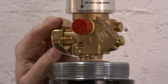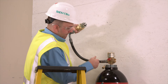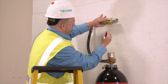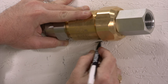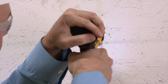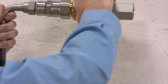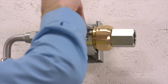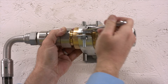Now you can return to the cylinder and remove the valve cap, then proceed with connecting the discharge assembly. For this video, we're installing the assembly in a horizontal layout for easier viewing. Most job sites would require this to be in a vertical orientation since the pipe will run along the ceiling. Mark the wall with the connection points and then remove the assembly. Prepare the mounting location for the strut rail and secure it to the wall. Connect the discharge assembly to the mounting rail — you can use Siemens' recommended clamps for the pipe and pressure regulator, or source your own locally. Make sure you secure them accordingly.